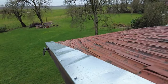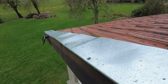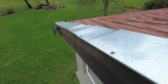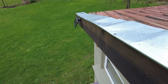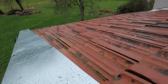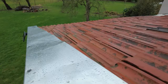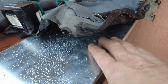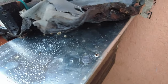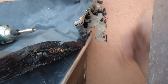It's peeing it down, bucket-full. So as I say, I'm just going to fix that one that's bumping up there, put one in the end, fix it in the end. As long as that keeps the rain out, then it keeps it nice and dry. And after the leak's sorted, I'll be happy with that. Then I've also got to put this back, the flashing. So we'll have to dry all this inside and then glue this. We'll get the heat gun on it and put this back down, plus put a little bit of blackjack on this wall at the back here to make them bond together.